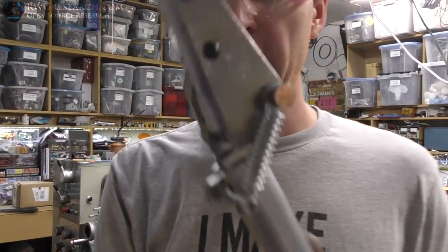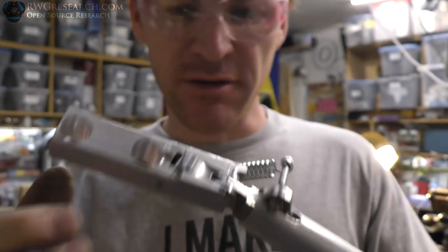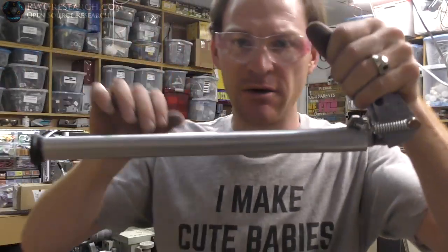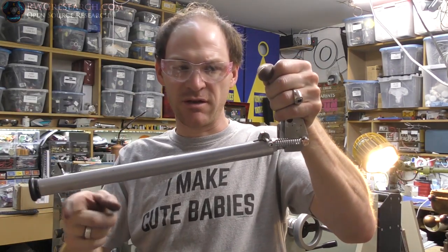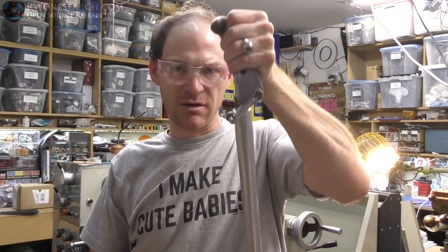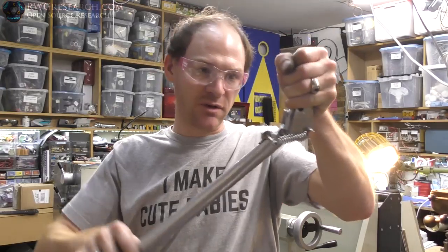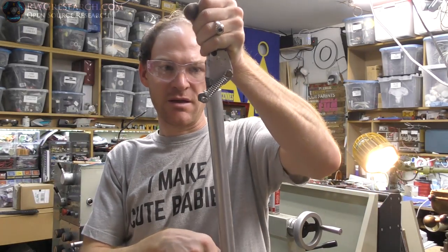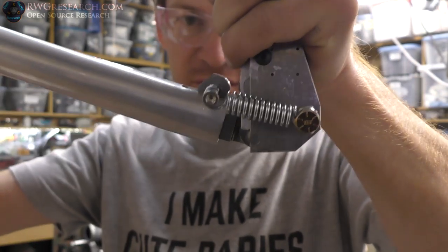Well, there it is. That is the kickstand. I need to probably put a bushing in there, plastic or other. But now, this is up, which is actually sitting against the bottom of the bike. So you can see, well, it's got a little bit too much friction, but it does pull it up. And if you go over center, it'll stay down. I gotta put something in there. I tried to oil it, but it didn't really help. Anyway, it does stay up, and it does go over center. You can see the pin is the center. So there's about center, and then there's over center.